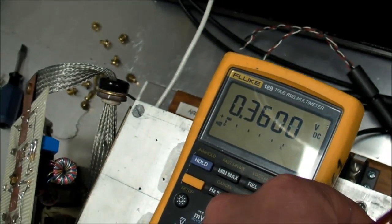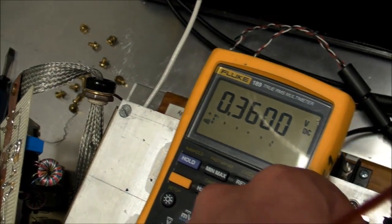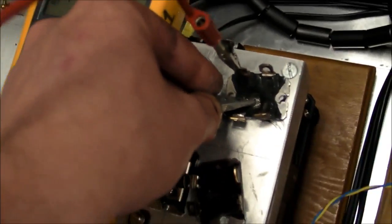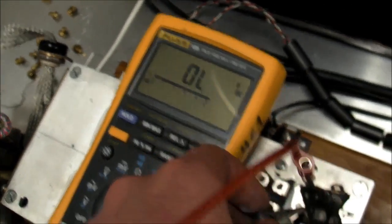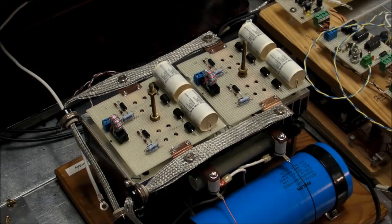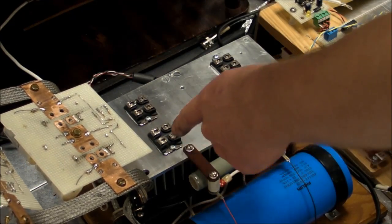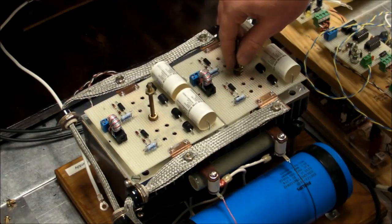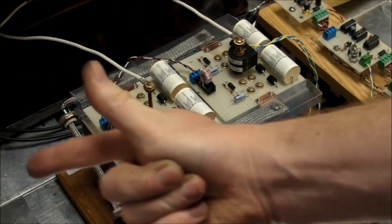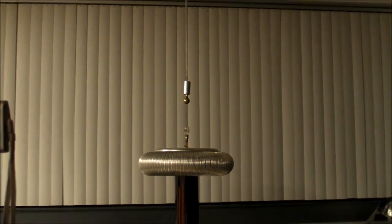I guess that means the diode in the package is on a separate die, right next to it. So we've got one die for the IGBT, and oh look — I'm poking right there and we get 0.36 volts. I'm no expert in power semiconductor construction topologies. So there are the new IGBTs on the heat sink — put these down and just like that it's all back together. Let's see if that fixed it.